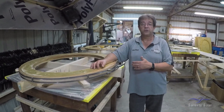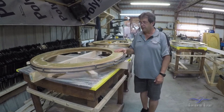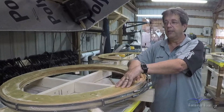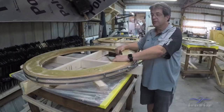We didn't have any drawings for the jigs, fixtures, and tooling to make the fuselage skins. What we did have were some nice factory photos showing some of that work, so you could get an idea of what they did dimensionally. We used SolidWorks 3D CAD software, generated the fuselage shape in SolidWorks to generate everything to make our mold and extract out all the tooling we needed. Everything works from a common shape. We drew that up and cut it out on the CNC router.